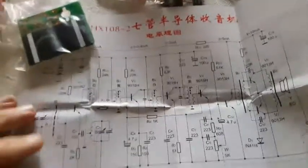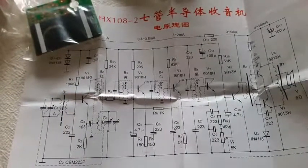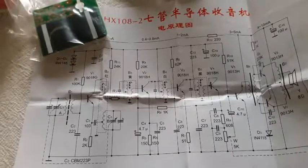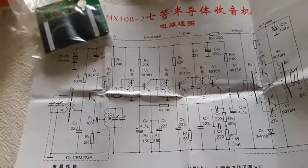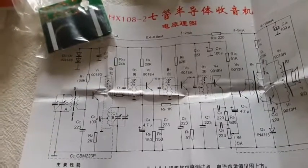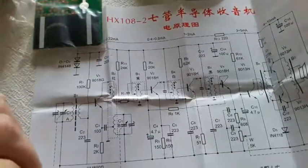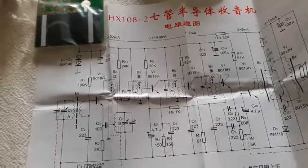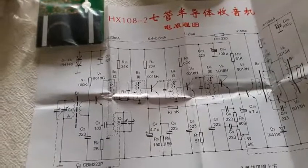This is not really much of a challenge to me, but what I'm going to do is build this radio and align it. There are two ways to align it: using a working radio to align station reception, or using a 455 kHz tone to align all those IF cans with the tuner capacitors. There will be multiple parts — I don't know how many.